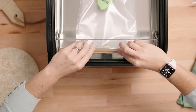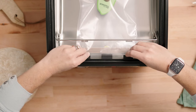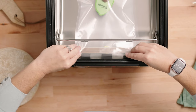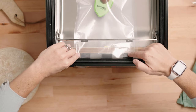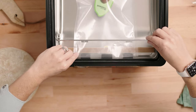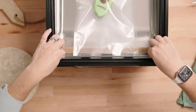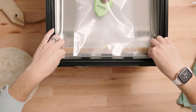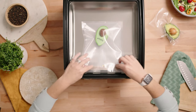That's going to allow the bag to stay open so that air can freely escape the bag when it's under vacuum. The outer edges of the bag will be placed on top of the outer tabs, and then the silver pouch clamp will lower and hold that bag in place. Make sure it's also smooth across the seal bar.